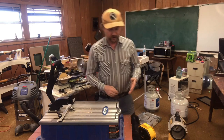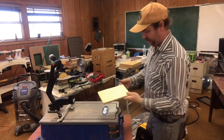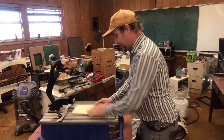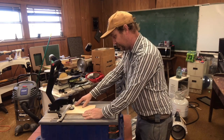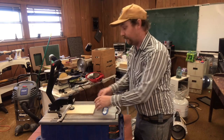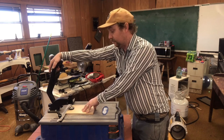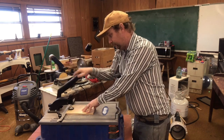This is a piece of half-inch Baltic birch right here — really nice material I did some cabinets out of. Let's drill a hole in this and you can see how quick this is compared to a standard Kreg jig. You have your piece, all you do is set this fence on half-inch. We want to put it dead center — since my piece here appears to be five and a half inches wide, I can set it right at two and three-quarter in each direction, and I know my pocket hole is going to be dead center. There's a little red button that keeps you from being able to start the motor, so you push this red button in with your thumb and then pull the trigger. Hold your board down until the clamp engages, start the motor, and make sure it's running before you start the pocket hole. Done.